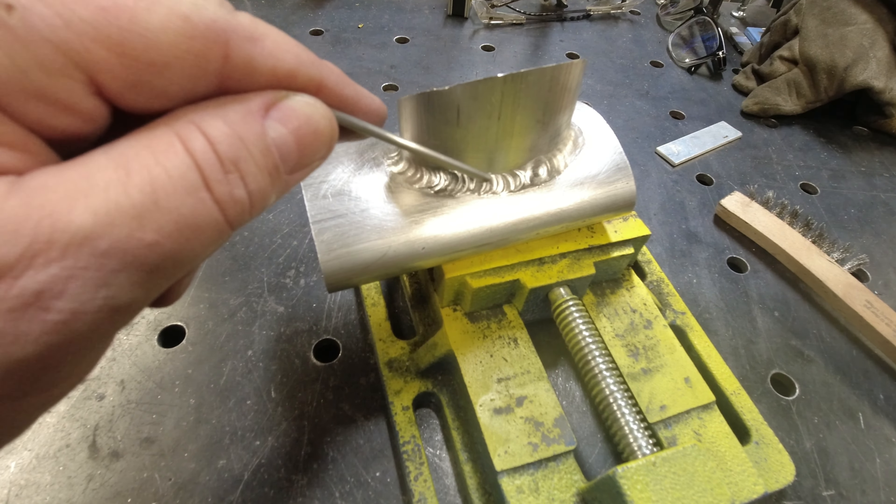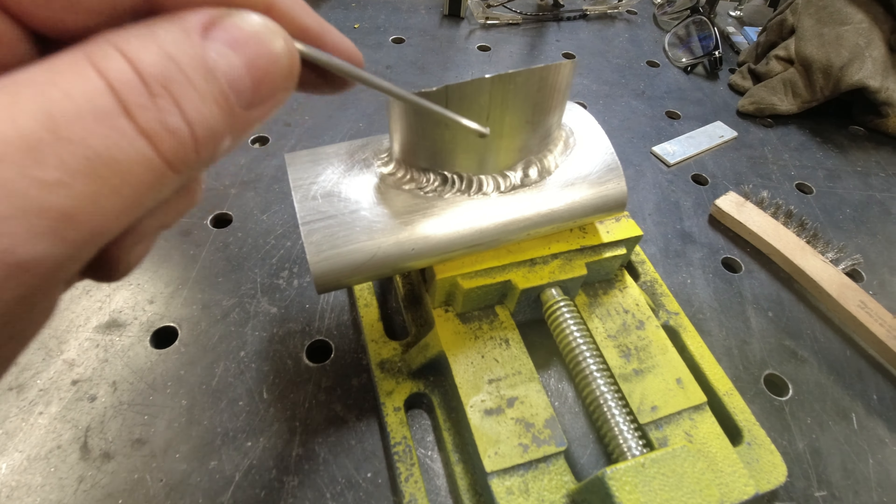Get some of that Neptune M rod and slowly work on it. You're going to get some black sooting — that's just part of the mag beast. One thing you're going to need is a bucket of sand. If this stuff ignites on you, a fire extinguisher is the last thing you want to put on it. You have to smother it, so just be ready to do that if you have to.